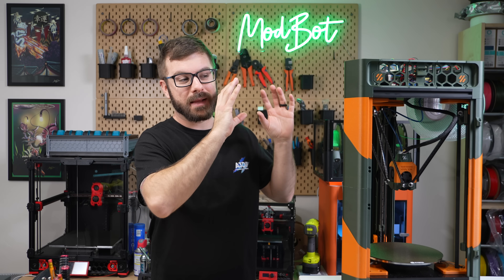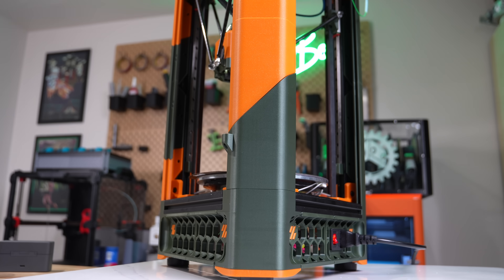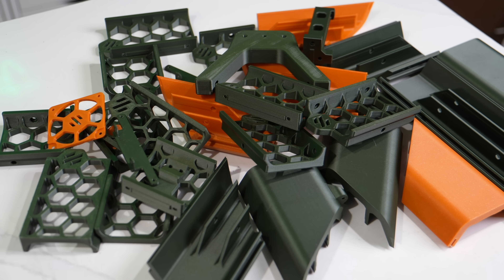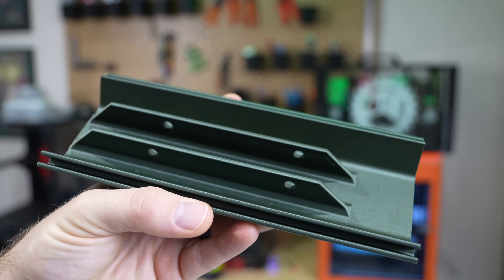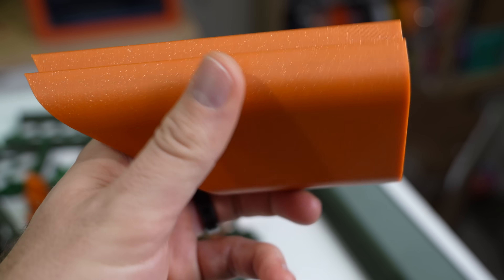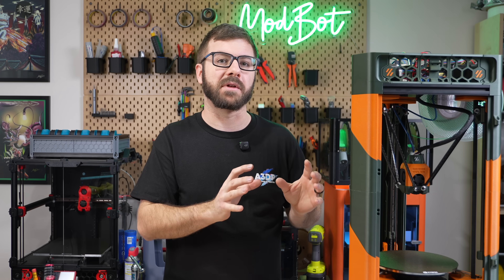Doron Velta has a lot of printed parts. From the skirts to the joints, toolhead, and extrusion covers, you want to make sure you have a printer capable of printing with ABS or ASA. It's approximately 1.5 kilograms for the primary color and 500 grams for the accent pieces. I stuck with the Voron part recommendations for the covers and skirts, which is probably overkill, so I used a little bit more filament with my build.